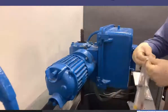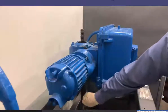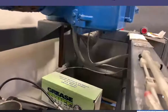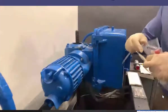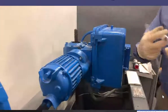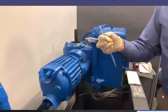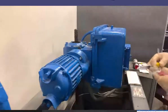This is one of the kits that comes with the stem key — it has a number of different tools, all protected to stay clean. The sample kit includes a plastic spatula you can get down in the yoke area to gather up the grease. Tools inside allow you to transfer that grease into a syringe and then into a sample container. The grease analysis I mentioned takes around one gram of grease — ten different tests can be performed with that one gram — all under an ASTM standard for grease sampling and analysis.